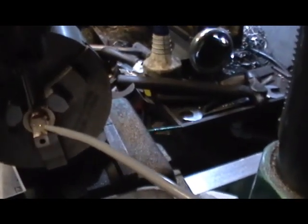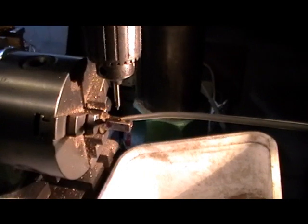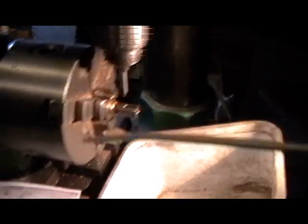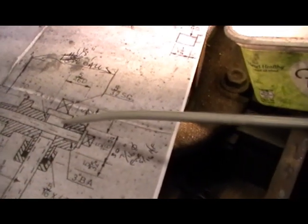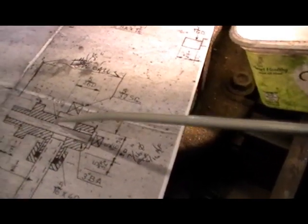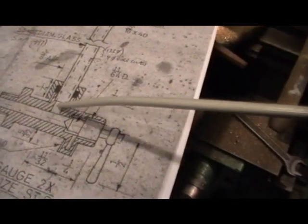I'm doing the top ones first. When I screw all my water gauge housings into this block, they'll all be the same distance repeatedly for the sight glass to be dead in the center. I'm going straight through with a five millimeter drill for the sight glass diameter, then at the top half of the housing I go through with a tapping size for quarter by forty thread, which is 7/32nds I think. Then moving on to the bottom ones, I screw them into the fixture shoulder — this hole here is a smaller hole just for the water to come through.